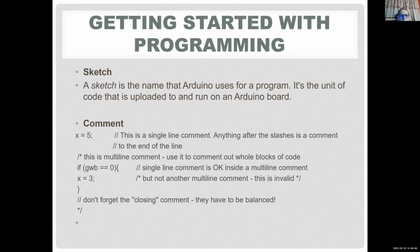All right. So sometimes you want to use comments. Most coding, you remember, well, some of you know, it's useful to add comments. Let's say in a year from now, you want to look back to your code and wonder, what was I doing? I have no idea. So you might want to add some comments there. A comment is something that's not visible to your board. Two slashes would be a single line comment. For example, you can explain what you were trying to do in that line.